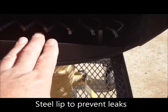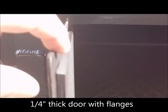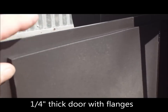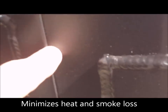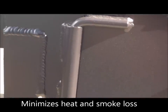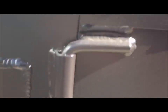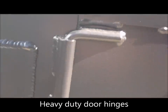It also helps keep your coals inside if you use this pit for grilling. You've got a quarter inch thick side door — we flange it with one inch flanging all the way around so it's nice and tight, no smoke leaking out. Nice tight fit all the way around, fully flanged overlapped flat bar. You have our heavy duty hinges that we make here in the shop — solid round bar with half inch pipe. These won't bind, they won't rust and break. They're fully welded on there.